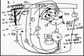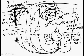So we can still indirectly tell if the battery's getting discharged. If this needle has come all the way up to the rated power of the generator, or it might be off a little bit. If we turn something on and the needle doesn't go up, then indirectly we can tell that the battery is what is producing the power to operate that other component, and now the battery is discharging. We just don't know how much.